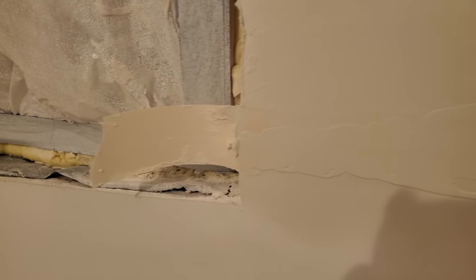There was a crack over there which the contractor said he covered up like five times, and basically when he was leaving he announced that it was impossible to fix. Tonight when I was sanding the area down I could see that something was going on — maybe it was a crack, maybe it wasn't; it could have been a shadow or a void. Either way, I couldn't just leave it. I sanded it as far down as I could, gooped it up, threw a piece of tape on it, and I've done one coat. I'll have to sand this down — it's pretty awful — and I did this with a six-inch knife.